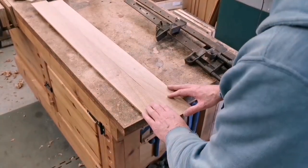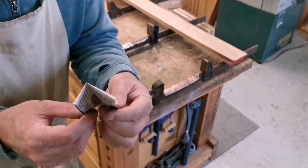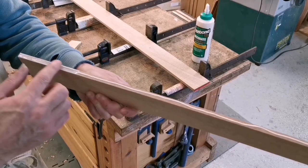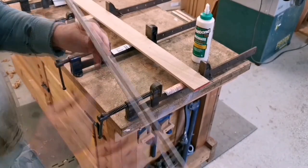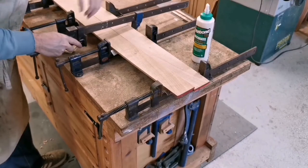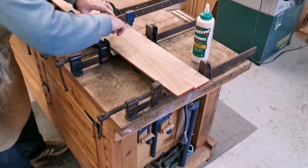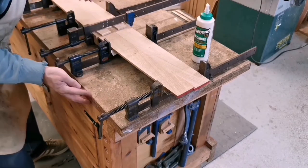Now they're jointed, it's about gluing these panels, these strips together to create panels. They're misshapen a little bit due to movement in the timber. I hang bits of paper over the sash cramp — that stops the glue from touching the cramp, which would turn the glue black and leave a black mark on the piece of work, especially with oak. I'll use Titebond Ultimate, the Titebond 3. I start in the middle of the panel — this is important — getting the joint flush and then working my way out both sides down the length of the panel, because you can adjust the panel easier that way.